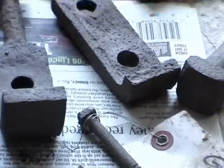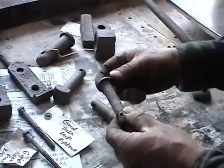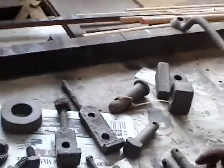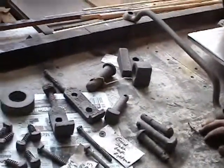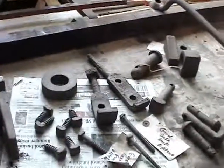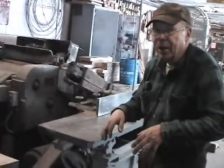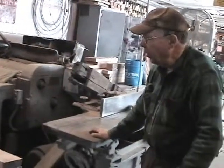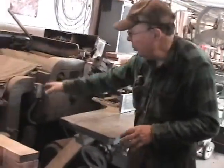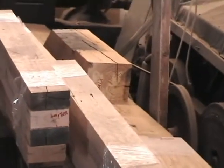Even the small lag screws right here. These are pins that go in the various brake rigging pieces. That one will straighten. We may get some new rivets like this — these were not hardened, so they wore and then corroded badly also. It's a judgment call; we obviously want this to be safe, but on the other hand we don't want it to be brand new. It is a thing called a pilot, or most people call it a cow catcher, though they didn't catch cows — they just basically kept anything away that would be in front. They're made of oak, and we had only a very few pieces but we have pictures and just enough to know what to make it out of. Next summer a gentleman who's a very good cabinet maker will make the two, one for each end of the car.